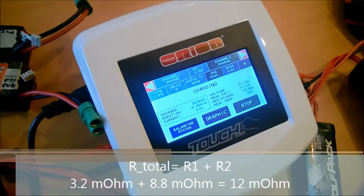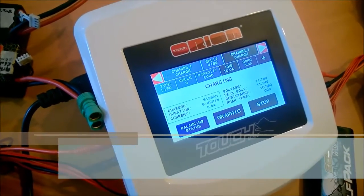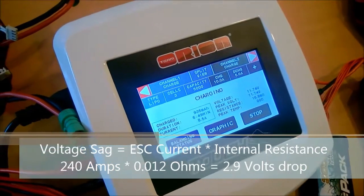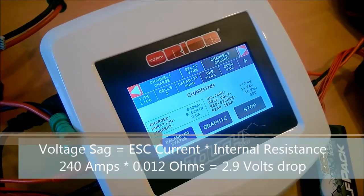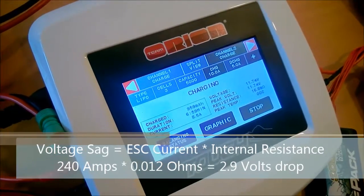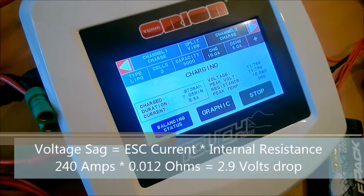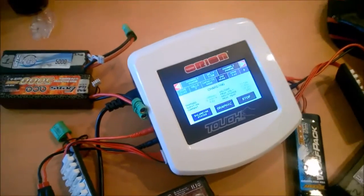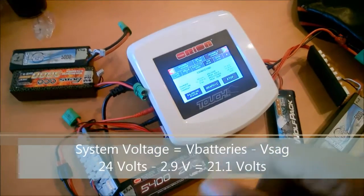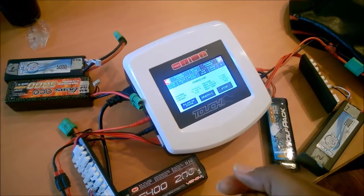In this case, I have two batteries that look identical but one is 3.2 milliohms and the other measures at 8 milliohms, giving me around 11 milliohms combined. Using Ohm's Law, I know my ESC — I was using a Castle Mamba Monster 2, though I've got a new upgrade I haven't told you guys about yet — can burst up to around 200 amps. At 200 amps, that tells me the voltage drops I was getting through runs, which is pretty significant. The lower your internal resistance, the less voltage sag and the more voltage available to spin the motor and get RPMs.